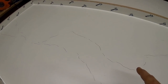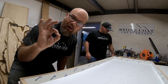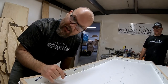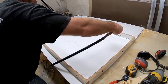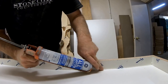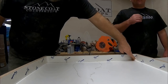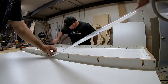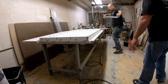We traced our lines in so we knew how our river went back in just in case we forgot. Let's silicone these joints so it becomes a watertight form. It's insurance. Silicone is a lot less expensive than a gallon and a half of epoxy. Applying Tyvek tape to the outside of our form is simply insurance just in case there might be a small hole or a leak for the casting epoxy. This ensures that we don't waste any.